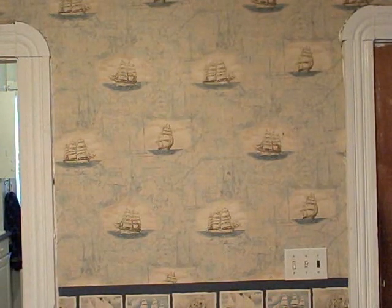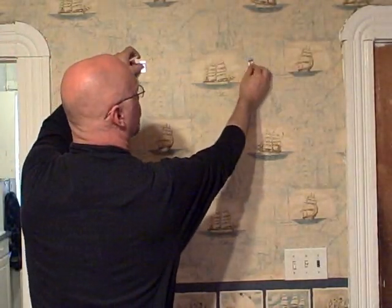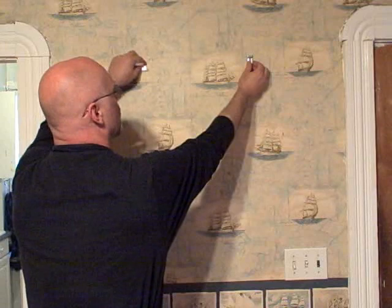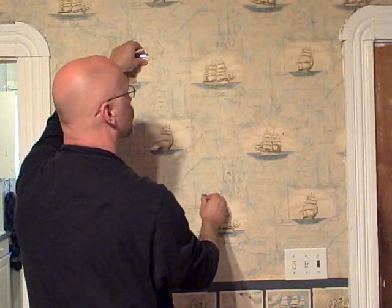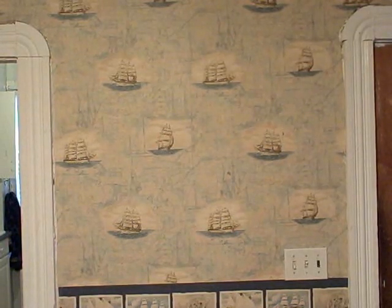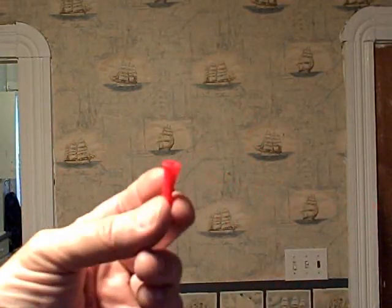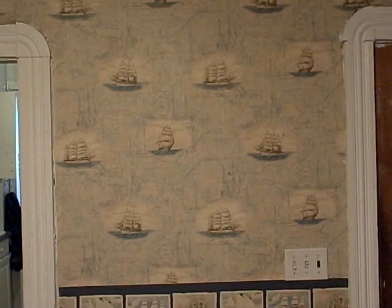I'm going to end up with these two brackets right on the studs. It works out well because the positioning is balanced — there's a stud here and a stud here, so I'll mount these on the wall. Then I'll put a third one down here, and the corresponding brackets on the back of the shadow box, and then I'll be able to put it right on the wall. There are a lot of different ways you can do this. I'm not going to use stud anchors — I don't think they're strong enough. I'm going to go with longer screws so I can get them really nice and tight.